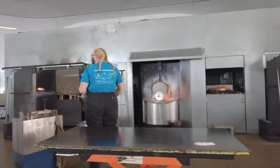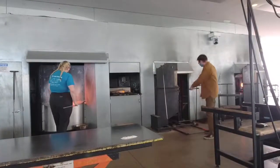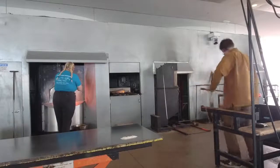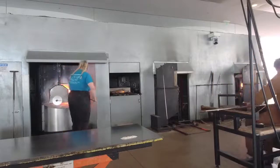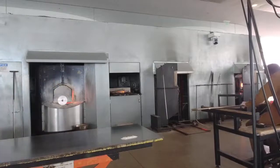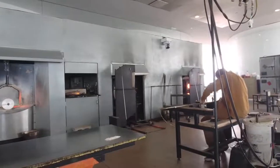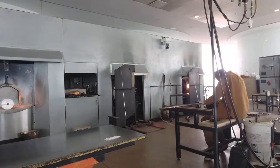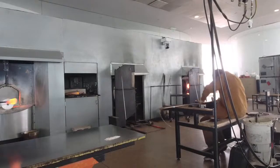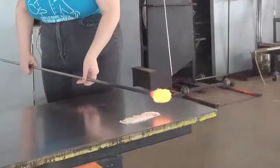And we're going to put something called a wrap on the outside of this. And a wrap is basically just wrapping it with glass, right? When we're working with stuff in here, the jargon is pretty simple. Is that good, Sandy? Okay. I'm going to cool my pipe off. You'll notice us coming to the pipe cooler. This is mostly because we want to have a really wide range of motion. So you want to sort of hold your pipe like a hockey stick. And if it's too warm, you have to sort of hold it at the end. And that can be far more challenging to turn.